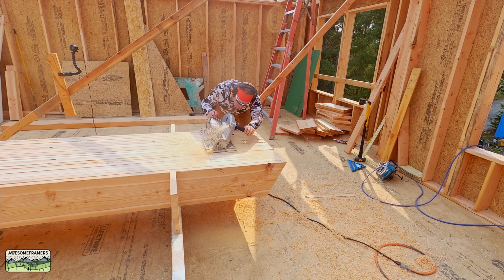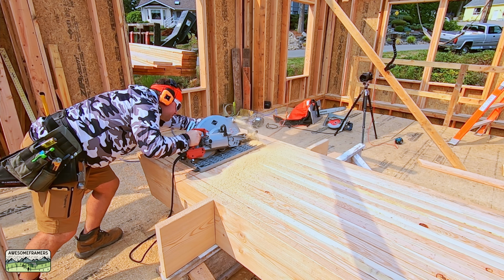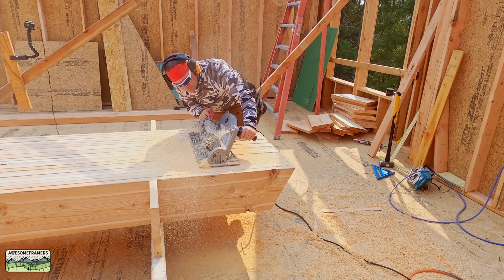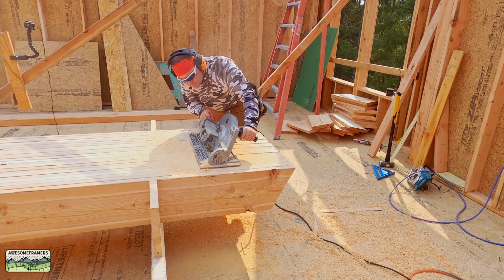Now this saw takes a lot of juice. So make sure you have a nice, big, thick extension cord and feather the cut, because at full depth, it will cut 6¼ inches. Take your time. It's not worth tripping the power and then having to run out to the power pole.